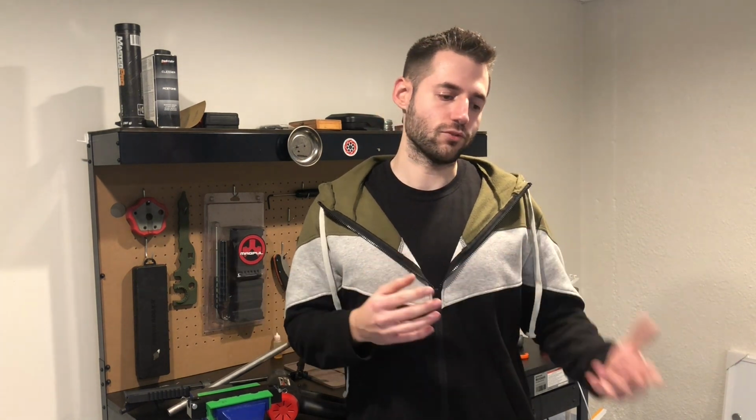Now, this doesn't answer our question regarding, well, what if the barrel gets hot? That's something that I'm going to have to do some testing later to see if I get any kind of vertical stringing from the barrel itself getting hot, and then the extra weight, basically the metallurgy or the metal becoming a little bit more malleable. Not anything that's going to trash it, but just enough to where the barrel might start drooping a little bit. So that's something that I'm curious about.